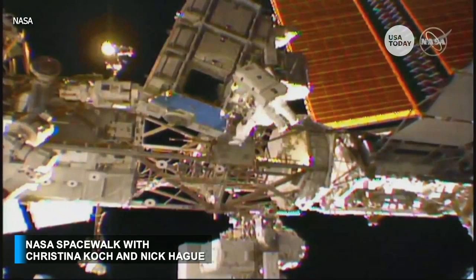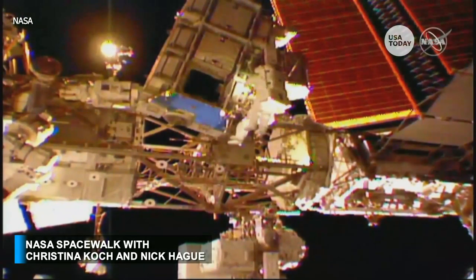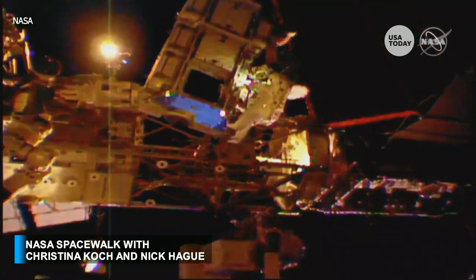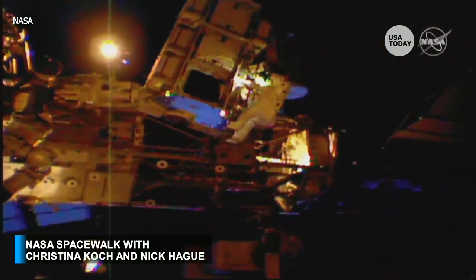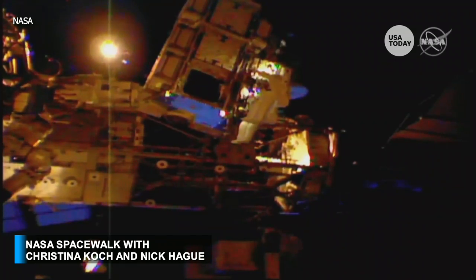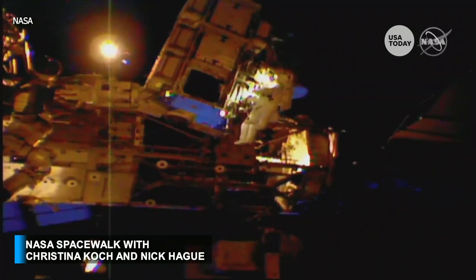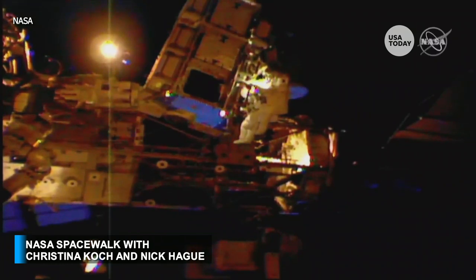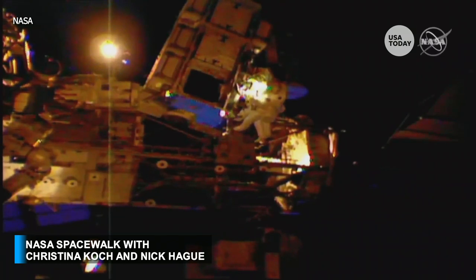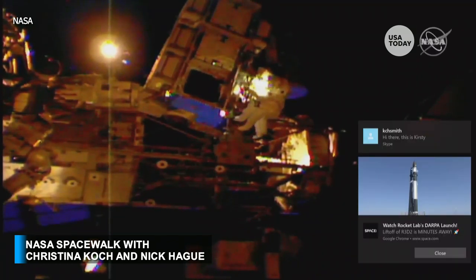It will, yeah. What's really neat is the batteries are able to be robotically removed, but the adapter plates always require a crew member to move them. So we have one adapter plate that we'll have to move. In order to do that, we will have the crew go get that on that third EVA. Hopefully next week we'll be able to get the robotics team in there. They'll be able to move those batteries, kind of do some choreography to help make the third EVA a little more efficient for the crew to grab the adapter plate, move that out of the way so we can put those nickel hydrogen back in. And we also talked a little bit about the battery discharge control unit.